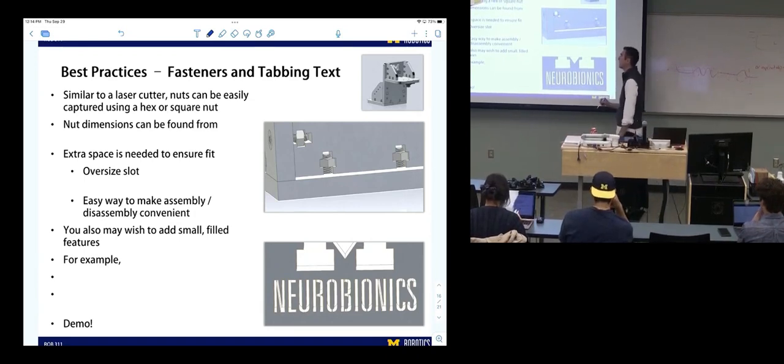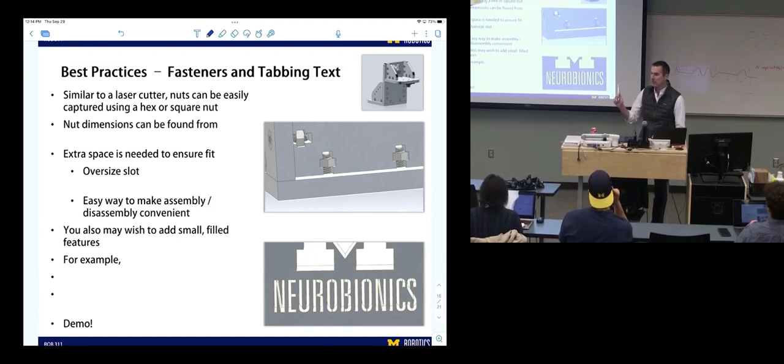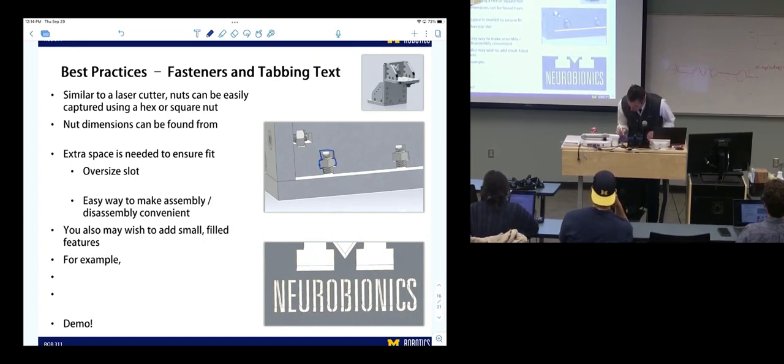And so now I'm going to talk through a few best practices, similar to laser cutting. It's actually pretty similar because it's a really similar process. So similar to a laser cutter, we're talking about including fasteners. This is the way that I think is best. You can also obviously create a hole and cap it. But I like to just capture these nuts. So same kind of deal here. This nut is captured. We have some space for the fastener to protrude through, and that holds it. We don't need any extra parts